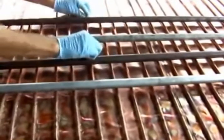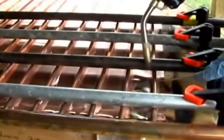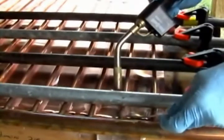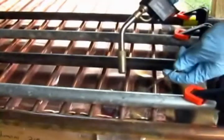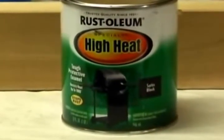At this point, you can straighten the copper tubes that are wedged between the black iron pipes. You will spend about an hour soldering the copper sheet to the pipes. The soldering process causes the copper to ripple — this is fine. The other side of the sheet is the face of the panel. I sandblasted the face of the panel to roughen up the surface for painting, then used Rustoleum high-temperature paint without a primer and sprayed the face of the panels.